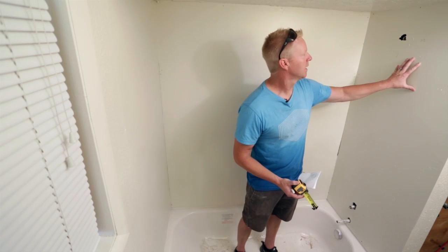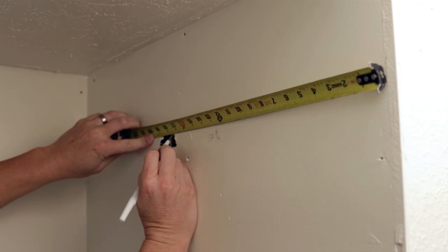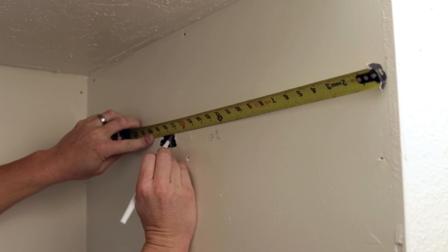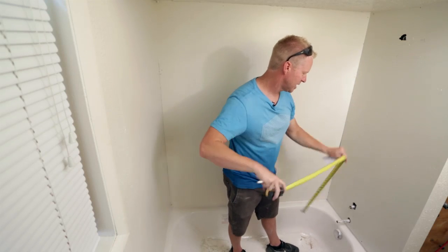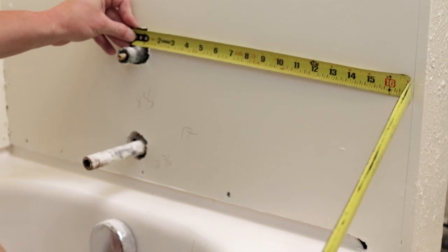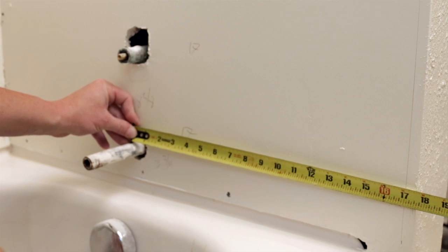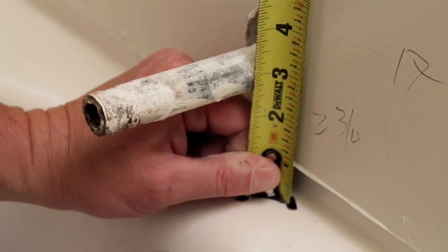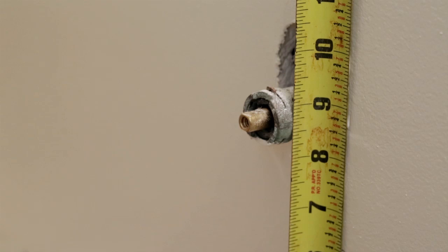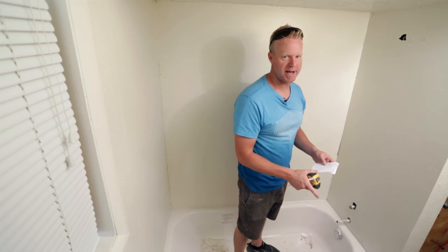I like to start with the wet wall first. We're going to take the marble to this point and finish it here. I'll pull my measurement from this point to the center of the fixture — in this case it's 17 and 7/16 inches. My next measure is from the top of the tub to the fixture, which is 58 and 15/16 inches. Then the lower two spigots: the valve centered to the finished edge is at 17 inches, and the spigot below it is also at 17 inches. The height of the lower valve is at 2 and 3/4 inches, and the valve is at 8 and 5/8 inches on center. I'll write my measurements down and copy them onto the piece we're cutting.